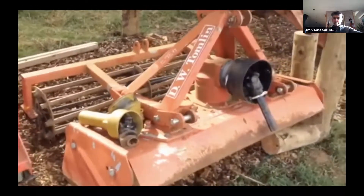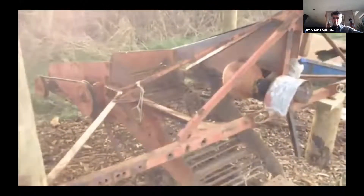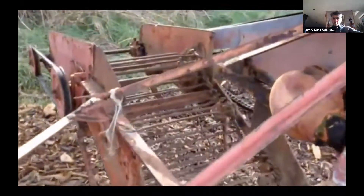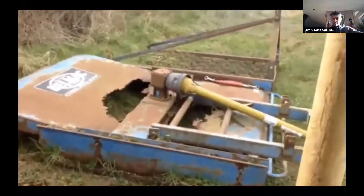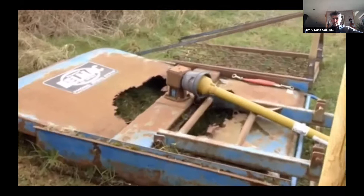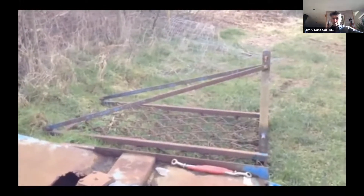We have a little rotavator — one of our first bits of kit, though we don't use it as much now we've got the power harrow. There's a potato planter donated by COCA CSA in West Wales — we did a little work on it and it works really nicely. The flail mower is one of the few bits we bought new — essential for flailing in old crops and green manures. The power harrow is gentler on the ground, leaves a good bed for planting. We've also got a potato lifter found in a barn locally, an old topper for rough ground, and a chain harrow mostly used for harrowing in green manure seed.